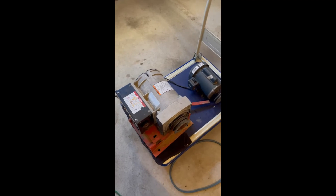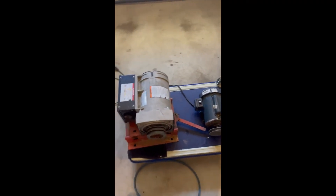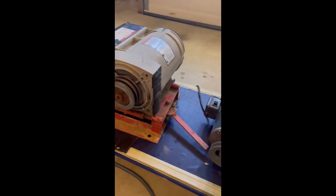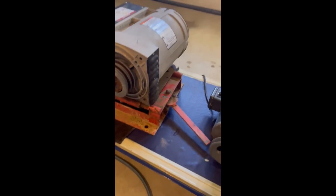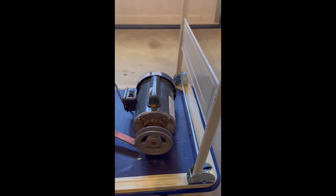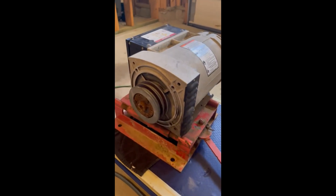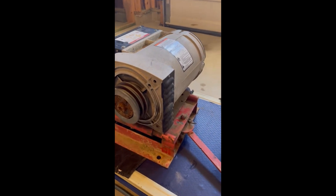It's reading about 3,450 RPM, with more speed on the pulley side due to the pulley size difference, so the generator gets up to its rated speed. I'll probably end up taking that old stand off. I'd rather have an auto tensioner — some type of spring-loaded auto tensioner for the V-belt. Once the inverter arrives, I'll hook the battery up, plug the motor into the switch, and wire everything in.